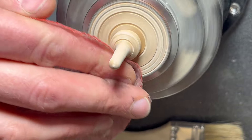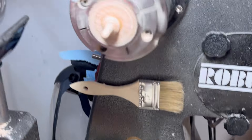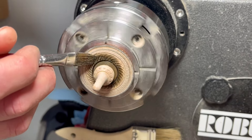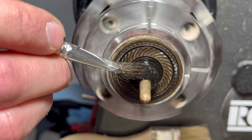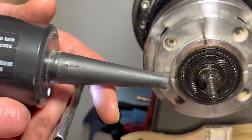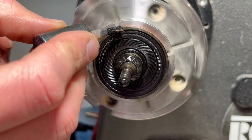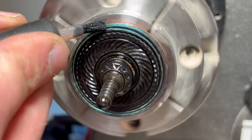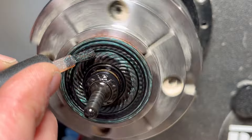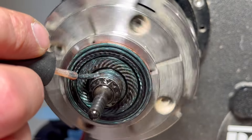Looks pretty good — outstanding. I love that flower. Sand it a little bit with 400 grit just to get the burrs off, no heavy sanding needed. I've got my banjo right underneath so it catches the drips, and I've got a little drip catcher — I don't like drips on my lathe. First coat goes on pretty light, and then I do a second coat. These little nail brushes are great because you can get into the details and really get right in there.